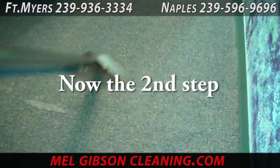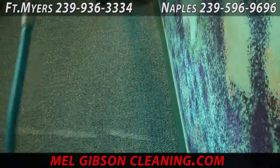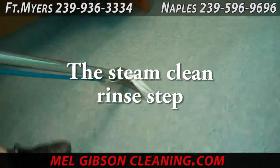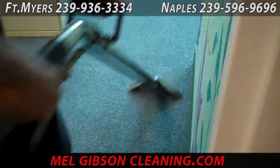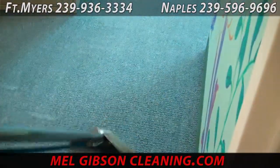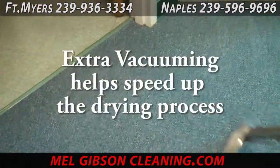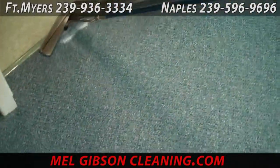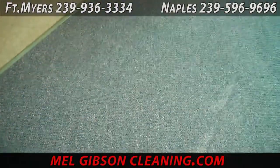Once all that dirt is broken loose, we do what most of you would presume is a steam clean — it's actually only half the job for us. Most companies are just now getting started, but we've got all the dirt broke loose, so it's easy now. We come in and steam clean, rinse and flush all that dirt and soil out of the carpet, suck all the excess moisture back out, and then take some dry vac passes to make sure we get all the excess moisture out. For areas that are really beaten up, we will occasionally go back in after this step and re-scrub those, then re-rinse them again.